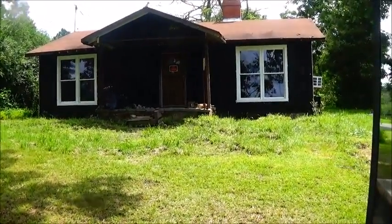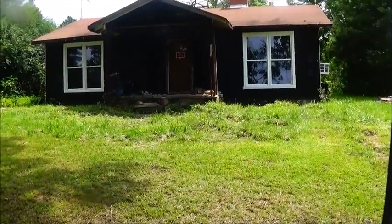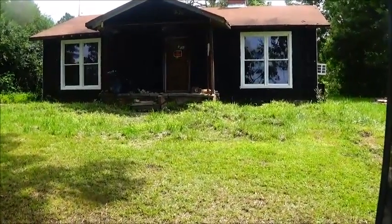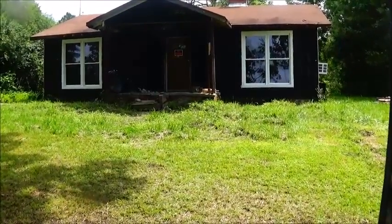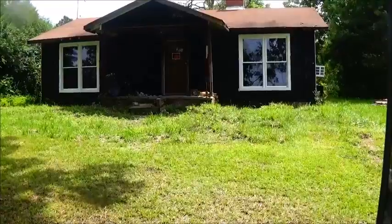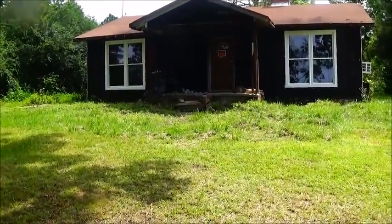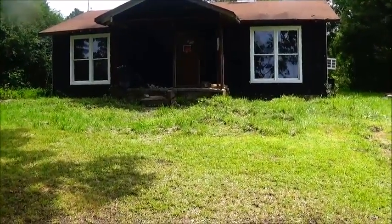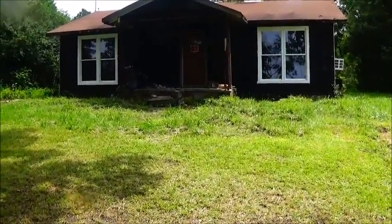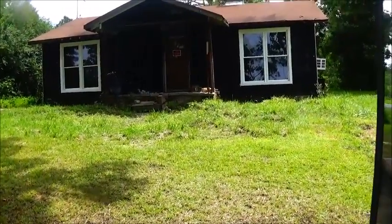Anyway, we've got all the windows in, getting ready to work on the fascia boards next, and get this old concrete and brick tore out from around this porch. And I've got to get the skid steer loader up here yet and get some work done, but we're moving right along. Them windows are in, they're in permanent good, and ready to go. And them are not new construction windows, they're replacement windows, so I actually had to build casings and then put them in place.